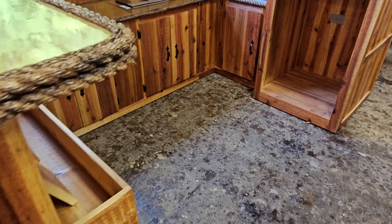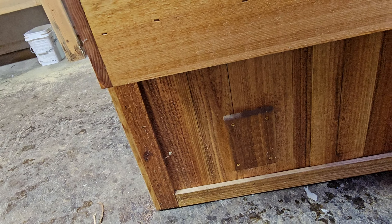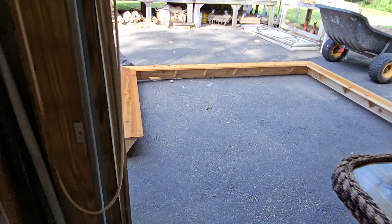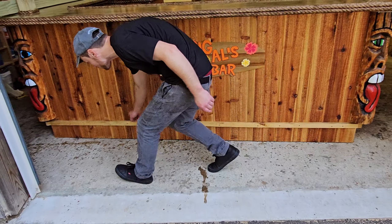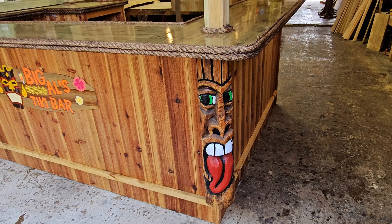Before we get to the footrest, we're going to do one more thing. Eric, show them the panel where the electric goes in. So right here, down here is your hole for your electric to come into, and it will tie into a panel — there's a panel there that unscrews. If you notice, the footrest bracket is cut so you can take that panel off; it's screwed in, so you can remove it to make it easier to fish that wire through, then screw it right back in. You tie — see that little wooden panel there that unscrews? There's a junction box inside.